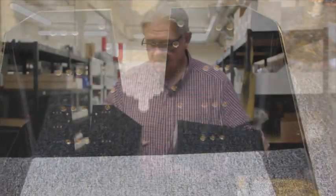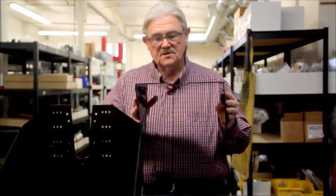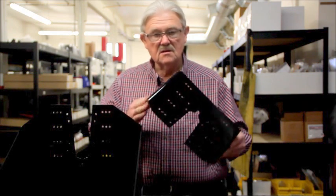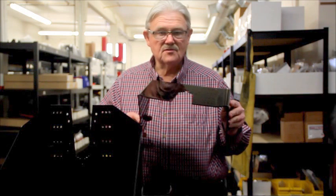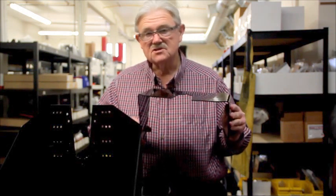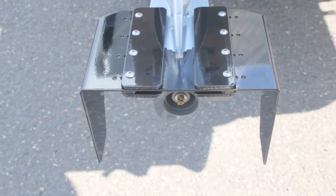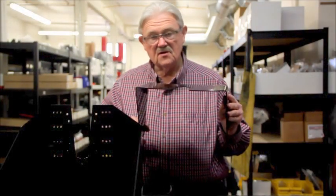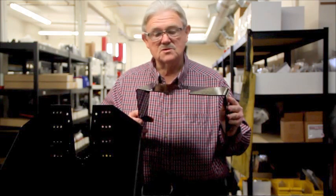You can see that we're about a foot wide. The Dolphin fin is primarily used on lower horsepower motors — say up to 30-35 horsepower — and relatively slower boats. So these are primarily used for trolling motors, kickers, that sort of thing. The material is a little thinner than the Orca fin because they're made to run at lower power and lower speeds.